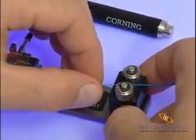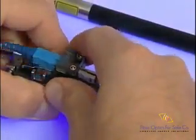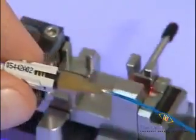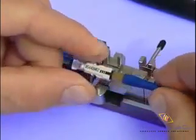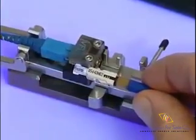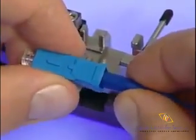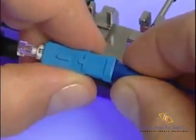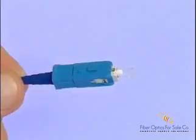To remove the connector from the installation tool, depress the release button on the fiber index and remove the fiber from the rollers. Then pull back on the slider to release the connector and pull it straight up and out of the tool. Use care not to pull on the fiber. Be sure to disconnect the Unicam connector from the CTS adapter and replace the dust cap. Slide the boot into place over the connector by grasping the connector assembly and pushing the boot forward. Note that it is important that the boot be on the connector before continuing. Locate the outer blue housing, also known as the shroud, and insert the white connector body into the blue shroud with the key of the shroud aligned with the date code on the connector body. Grasp the boot and snap the shroud into place — it does take some force. It is recommended to clean the connector end face aggressively with the alcohol pad prior to installation into the patch panel. This concludes this section.